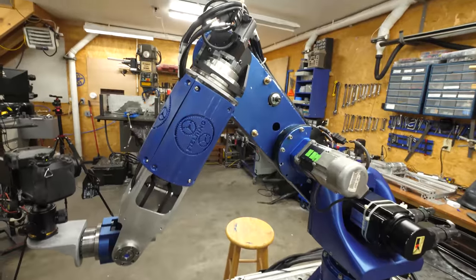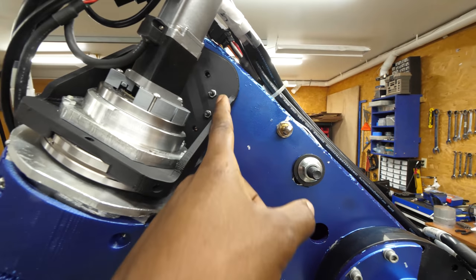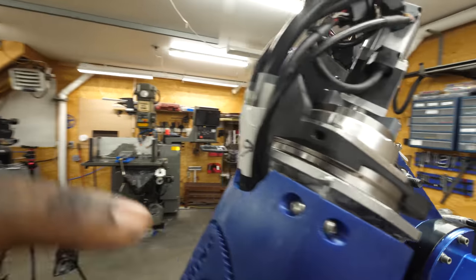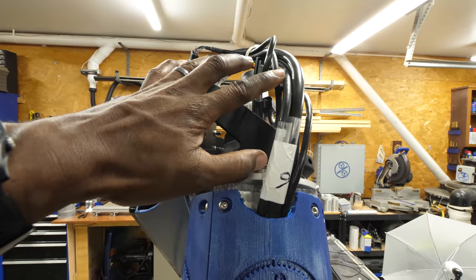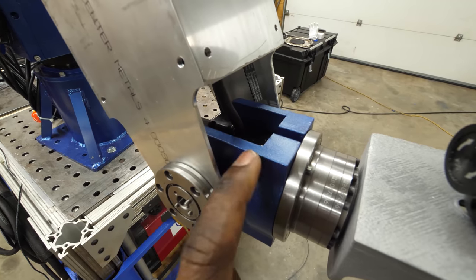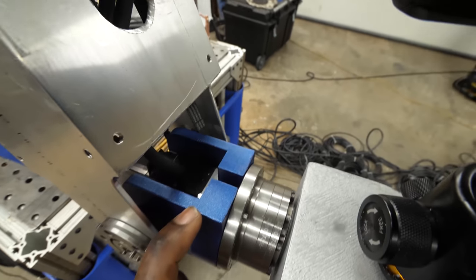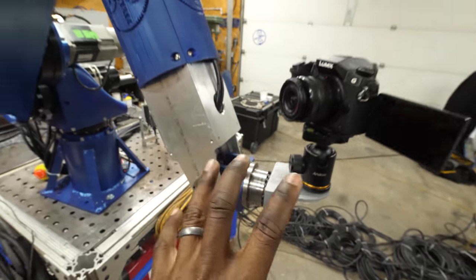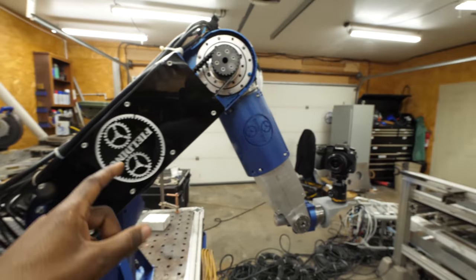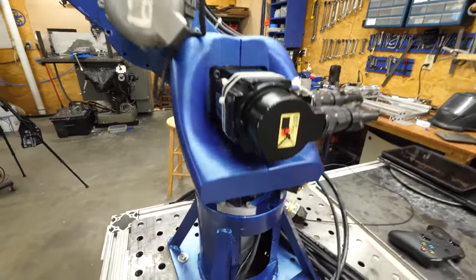Here is the robot under construction — it's not quite done yet. I've 3D printed two critical parts. This is supposed to be 6061 aluminum with some brackets welded onto it. It's a complex piece because it needs to be carefully welded and machined on several sides, with tapped holes and a cover on top. Another piece currently 3D printed will also eventually be made out of 6061 aluminum. I decided to 3D print these so I could test the assembly. This assembly will have seven motors when complete, but right now we've got six.